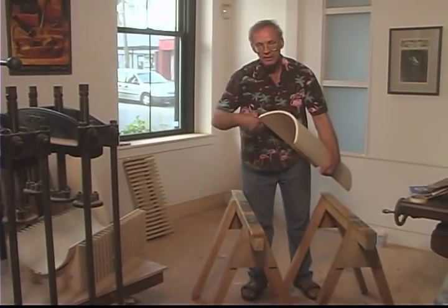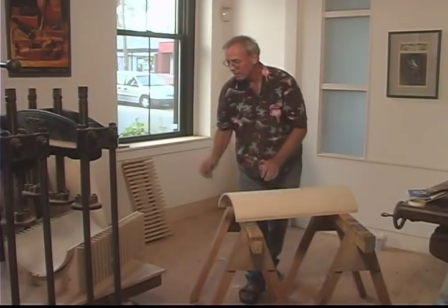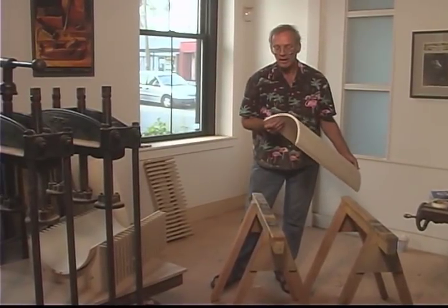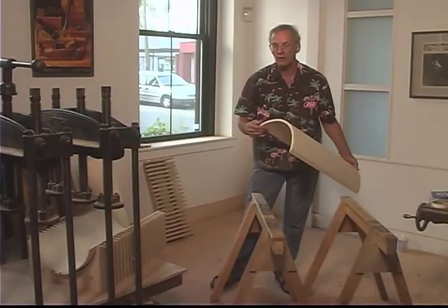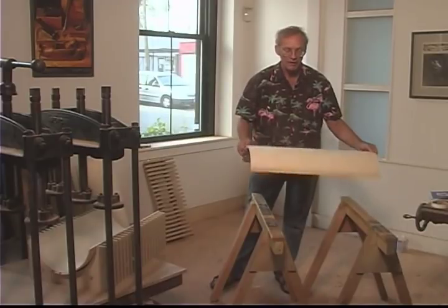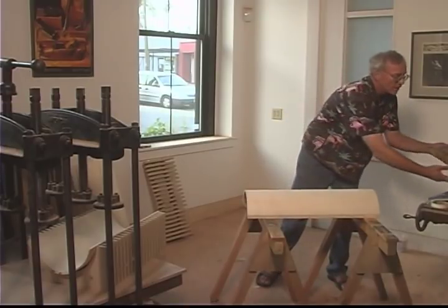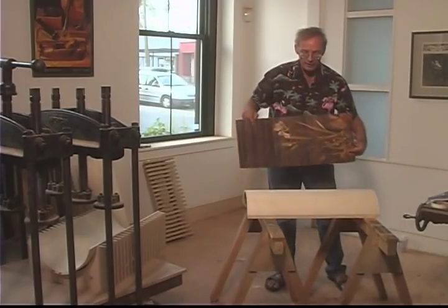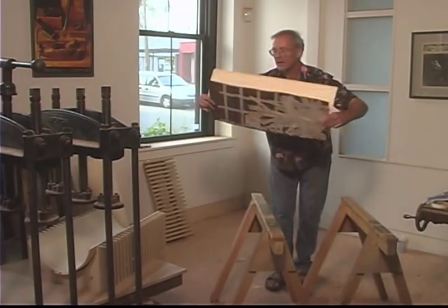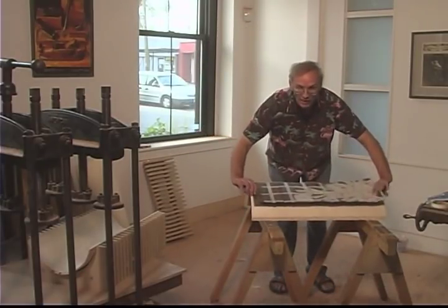I've already bent this piece into one quarter of this ellipse, and I've done that in a two-part mold. I've taken thin pieces of plywood — thin enough to bend into that curve — put glue on them, put them in the mold, and after the glue sets up it holds this shape. Then I've trimmed this wood and now it's ready to get the marquetry glued onto it. So I'm going to put the glue onto here, get it taped in place in the proper orientation, put the whole package into the mold, and let it sit overnight until the glue sets up.